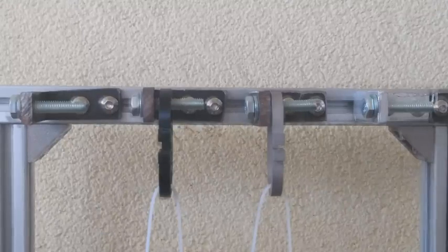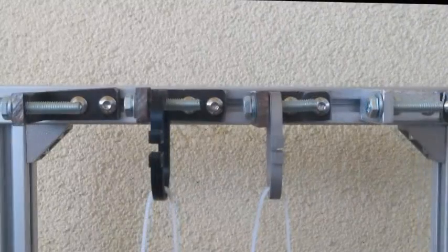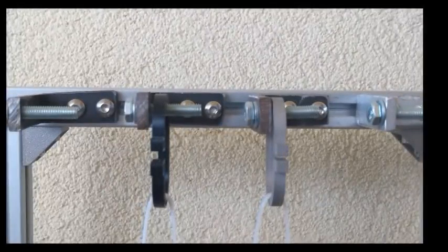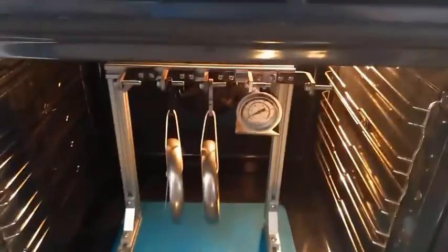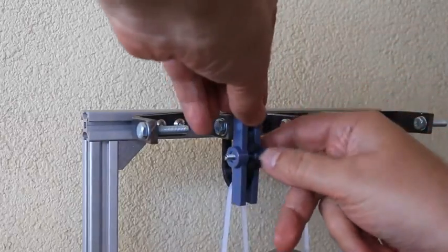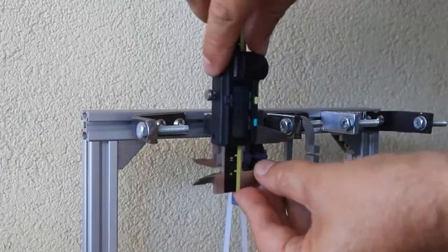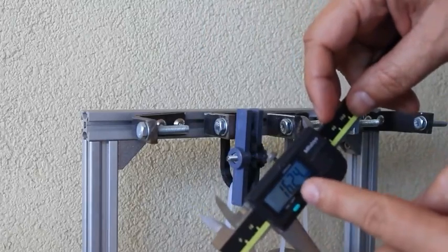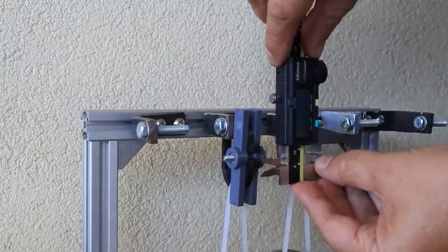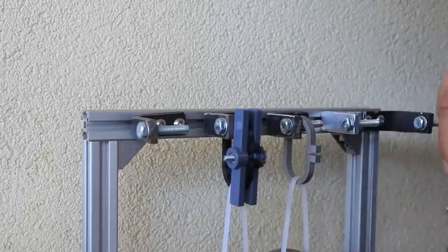Day zero, day one after 24 hours, day two, day three, day four, and then one hour at 50°C — actual temperature inside was 53°C. Final measurement: ABS reads 16.24mm — almost no deformation, no creeping. Stainless steel reads 12.24mm — no deformation at all.